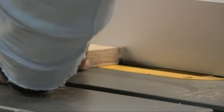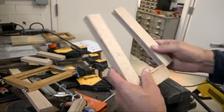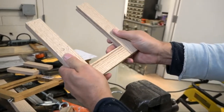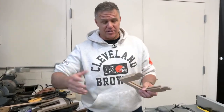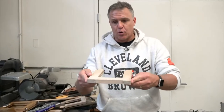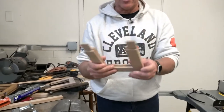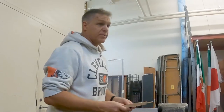You can see how I'm starting to take more of this away — eventually it will leave my tab. Once your bottom is attached to your sides, repeat the process all the way around three sides of the frame, leaving the top unfinished for now. I had to do some work that wasn't on camera. Basically, all I did was put some wood glue inside the grooves, then I used clamps to hold these tight. Now they're full, they're together, everything's good. Those tabs we left on the side pieces will hold our top pieces together.